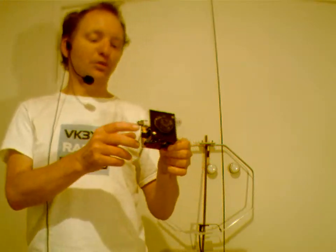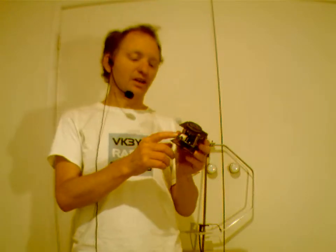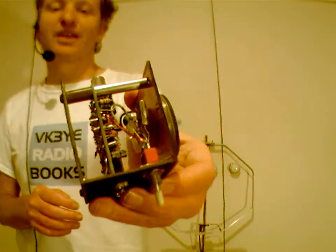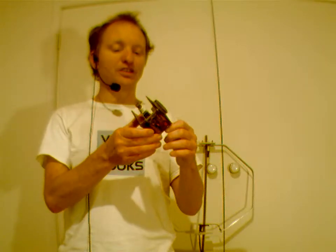This particular version of the Pixie is something that I've modified. You can do all sorts of things with them. Like, I converted one to an AM transmitter. I used the LM386 audio chip, although that's normally used as an audio amp on receive. I wired it differently, so it's now an AM modulator, which can modulate the transmitter section. And I built an AM transmitter on both 7 megahertz and 1.8 megahertz. Another thing you can do, you can put in a ceramic resonator. You might be able to see it, maybe not in the picture you see here. And there's a switch that switches between a crystal and a ceramic resonator, and that gives a bit of frequency agility. So if you wanted to build a little 7 megahertz receiver, then the Pixie is a possibility.